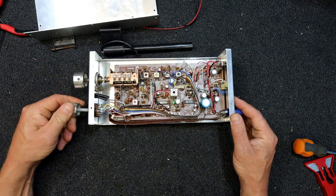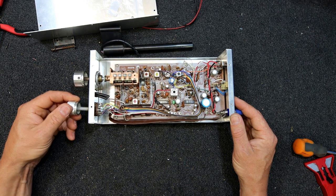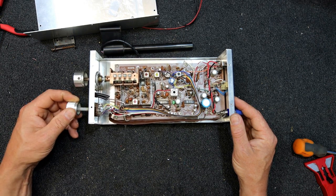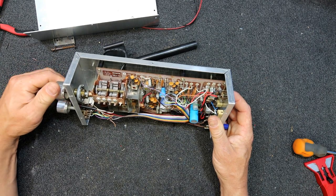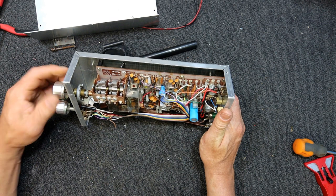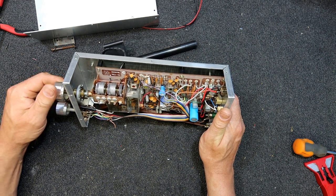It looks like what we've got is, I assume, 1, 2, 3, that must be a band switch, I would think, or maybe power on and AM FM or something, unless it's got shortwave or something. But then obviously got a big tuning cap here, and this has got like one of these reduction drive things. So I turned the knob quite quickly, but it's only slowly turning the tuning cap. I think they were called a vernier drive or something.